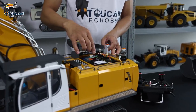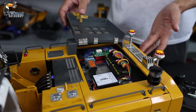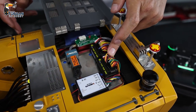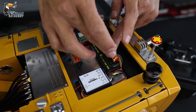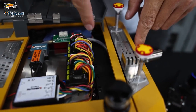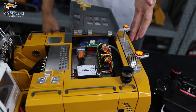As we've already filled up with smoking oil and hydraulic oil, we can already start running it to see all the functions. Here we've got two receivers. This expert model has so many functions and so many plugs. Down here, we can see it has one, two, three — six channels, and six servos, so six directional valves for the hydraulic oil.